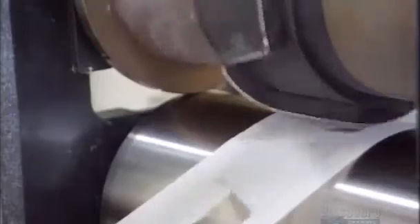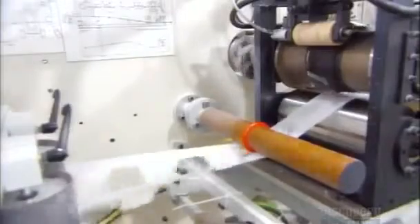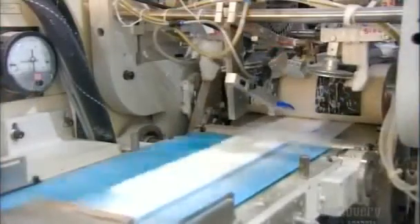Each diaper will be equipped with a set of front tabs punched out by a rotating die. This cylinder applies stretched side panels to the top part of the diaper, which has the leg cuffs and gathers. The absorbent core now meets up with the backside of the diaper, and then the other layers come together and adhere.